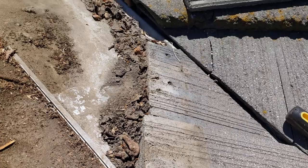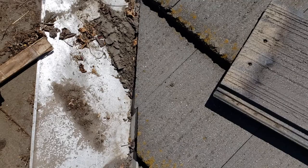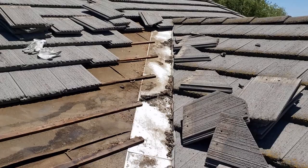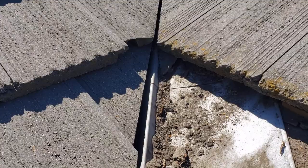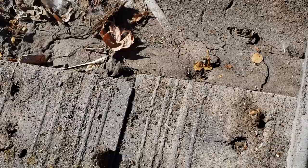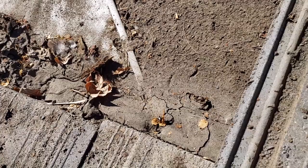You can see the valley is completely dammed up right here. Water is getting off the metal and getting onto the paper. You can see how all the dirt and leaves have dammed this up in three different locations. The result of that is a lot of wet paper. You can't get a much better example than this of why a tile roof will leak. The debris has come down, it's created a dam right here, and that dam goes all the way off the metal. You can see water's been flowing on it — you can see the cracks in the dirt and dust. So water comes down the valley, hits this dam, goes off the metal onto the paper, and can either burn holes in the paper or find a place to leak.